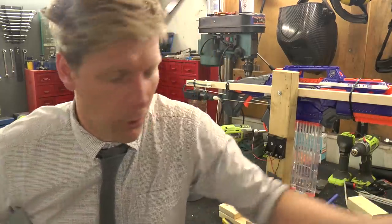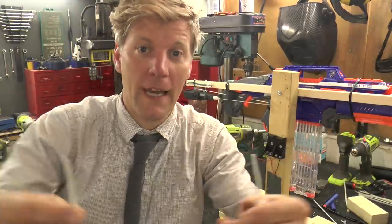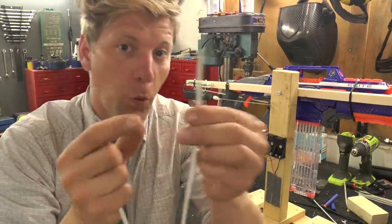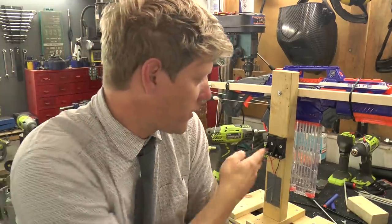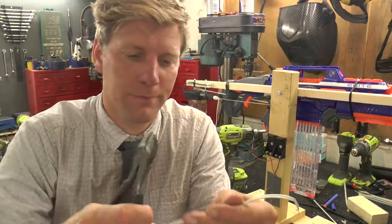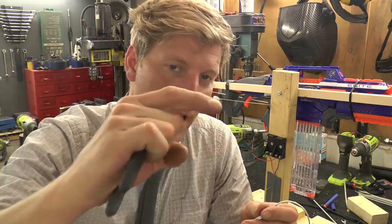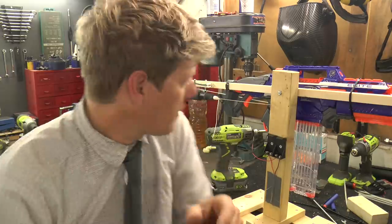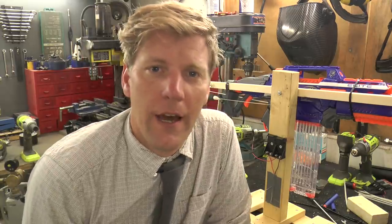To wire it up is very simple. You've got a long bit of two-core cable with two ends. Put one end's two wires into the actuator, and then the other two wires are going to be for your switch. At any point down the cable you can just cut one of the wires, peel it out, trim the ends up, and then connect your battery positive and minus to those wires. It doesn't matter which way around you go until you push the button and find out if you're firing it in or out — if it's the wrong way around, just swap the cables around at that end.